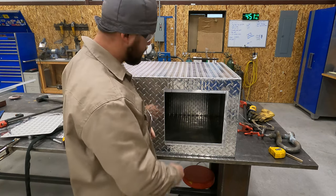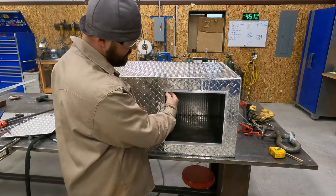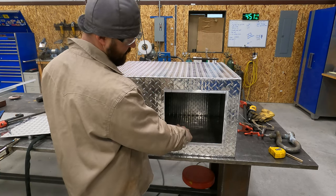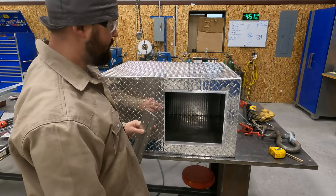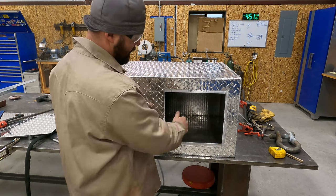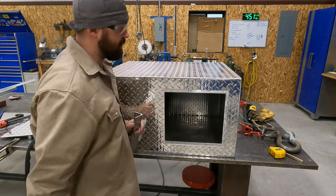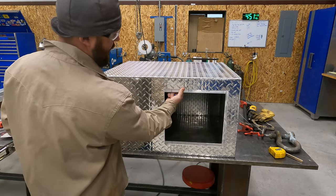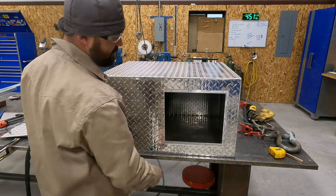I don't want to do that, so I'm going to cut these little pieces out and then I'll re-weld. I'll just put another stitch on the inside here on both places. That way when the door's shut, the hinge sits back where it needs to so that the whole thing is flush. So I'm gonna hurry and cut these and then add a stitch weld on the inside to the end